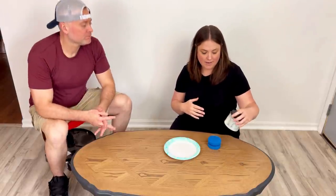A regular sealer would be fine, but we want something that's water repellent in case somebody spills. We want something a little bit more heavy duty. Varathane makes a triple thick water-based polyurethane, but it's really hard to work with. I've worked with it a lot and it's an excellent product if you can do it right, but it's really hard to work with.